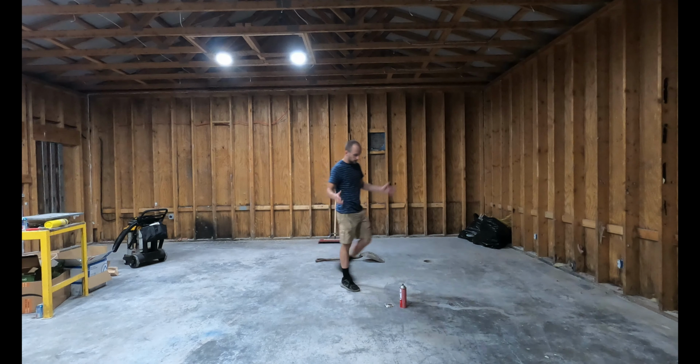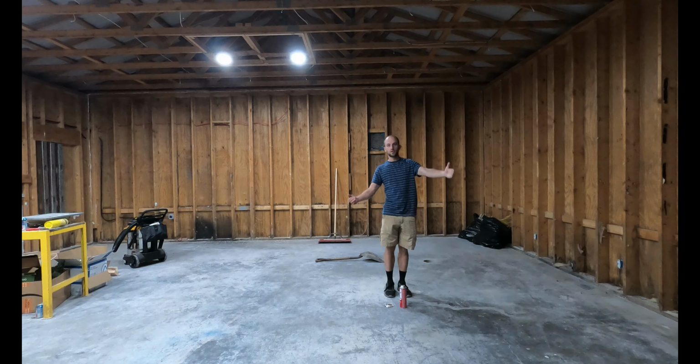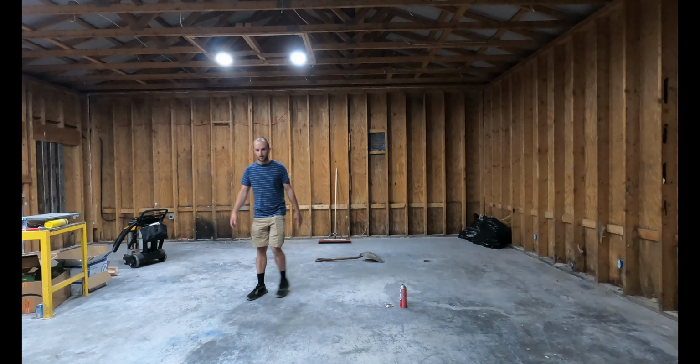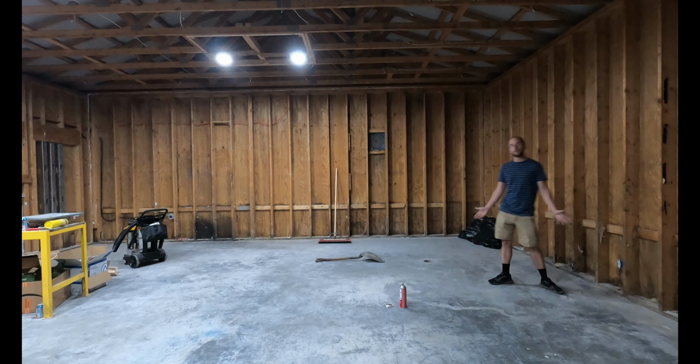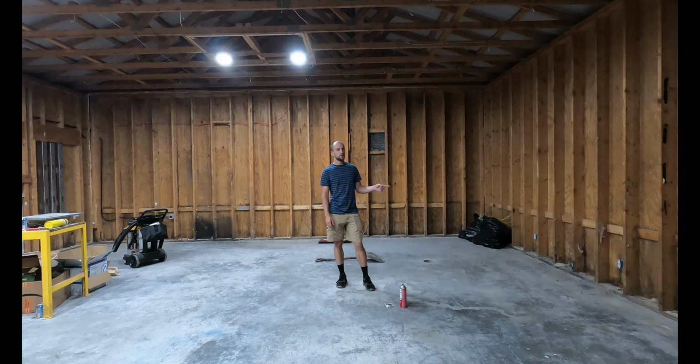From there, I made my 12-foot mark, and then I measured the doorway and the space on this side of the door to the wall, which is 10 inches. The doorway is 12 feet, so 144 inches. I found the halfway point, I made a mark there, and then I looked up the overall width of the two-post lift, and that's 141 inches, so I had to go, let's see, what would that be, 70 and a half inches in this direction, which puts me somewhere over here, and then 70 and a half over here, and the post will be centered on the garage door, and it should look pretty good and be pretty functional. The only downside is that post might be a little close to the wall, but if I have to get around the truck, I guess I can just walk around. I'd rather be centered. So that's where it is.